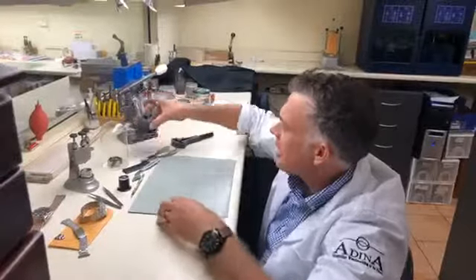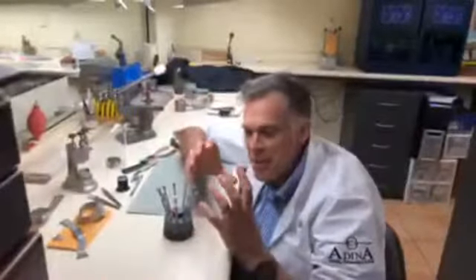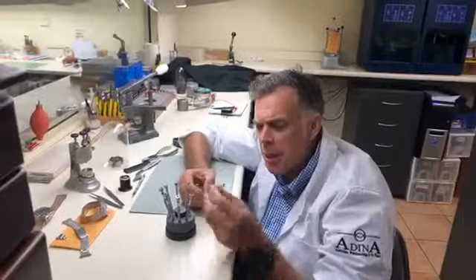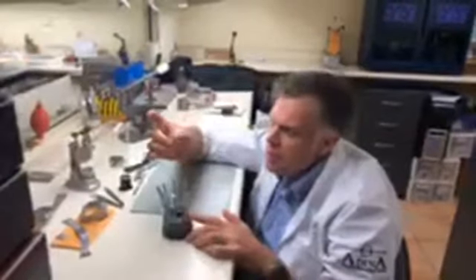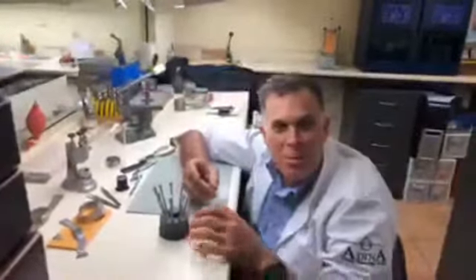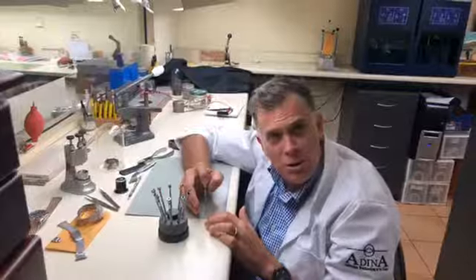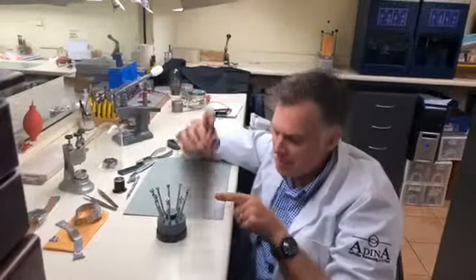Something that's always being used every day is your screwdrivers. They're coloured for a reason — each colour denotes a different size. Some of the more common ones we use are your reds and your blacks. The technique is very different from the ones you might dig out of your tool chest at home. We place the screwdriver across the screw just a smidge smaller than the head of the screw and then guide it and twist. The screwdriver actually has a twisting action inside it, and we're always sharpening our blades to make sure they're absolutely spot-on.